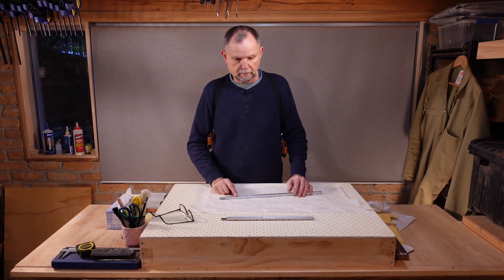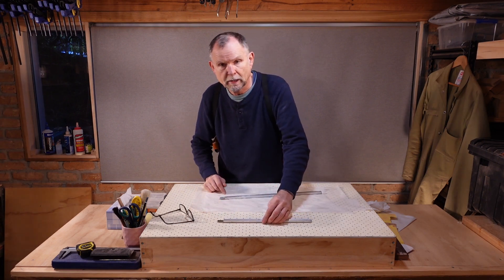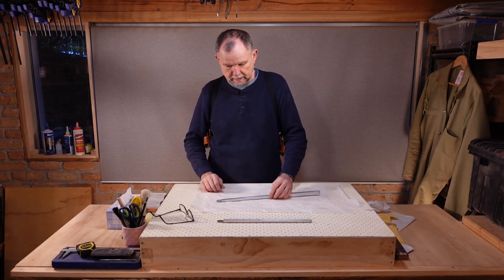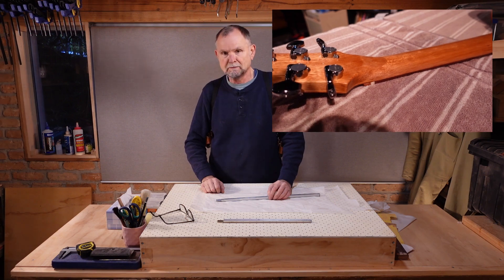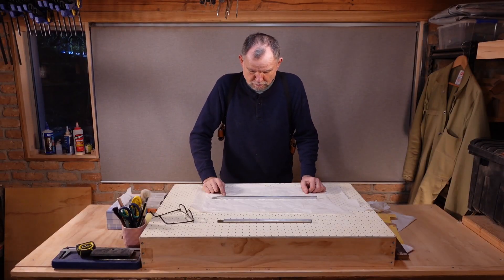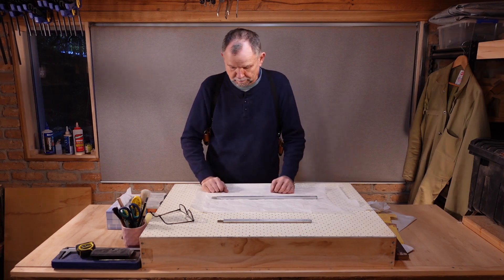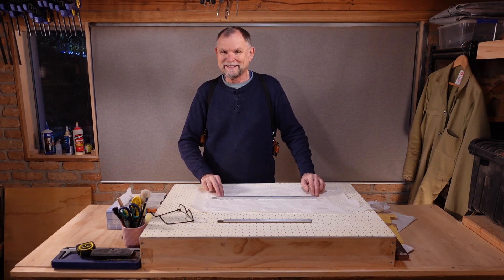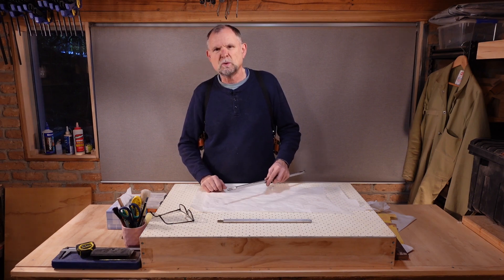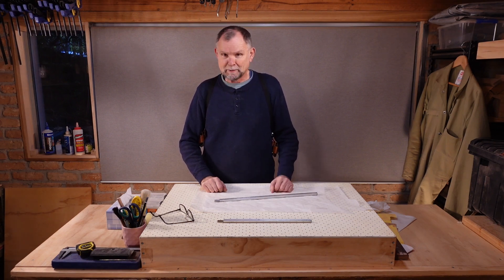So how does mine compare with this commercial unit? The obvious difference is that this one lays flat because the underside is a straight line, whereas mine, where these flaps were folded under, they kind of stick down a bit. That's not a problem with my guitars because I put a lovely volute underneath the nut and my heels are quite chunky. Truss rods, as you understand, push down at either end — at the nut and the heel — and up in the middle, so it's important that there be plenty of wood underneath. The other thing is that I'd like to improve my welding game so that we don't get these voids in the tensioning nut. But apart from that, I'm very happy with what I've been able to come up with.